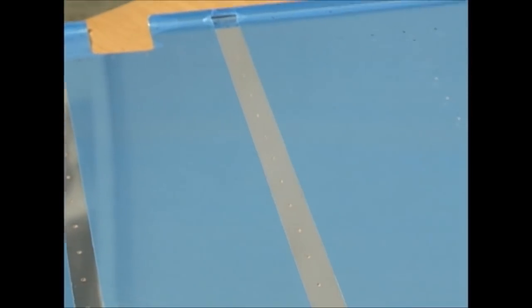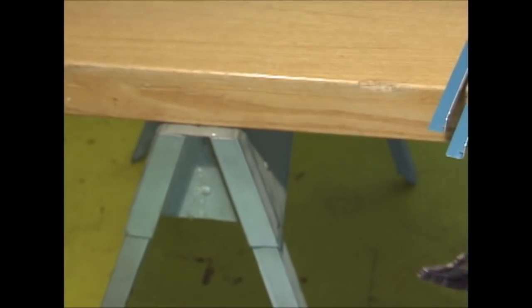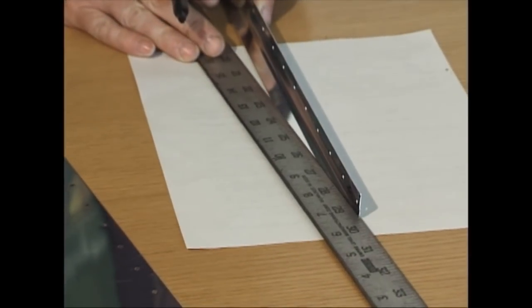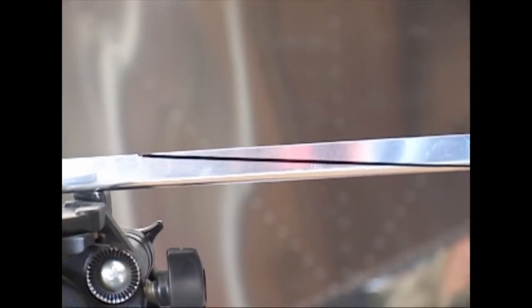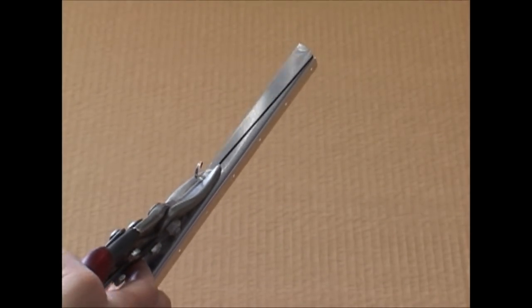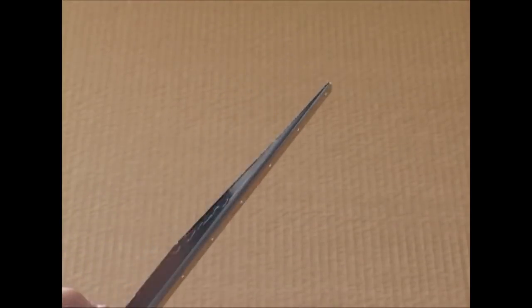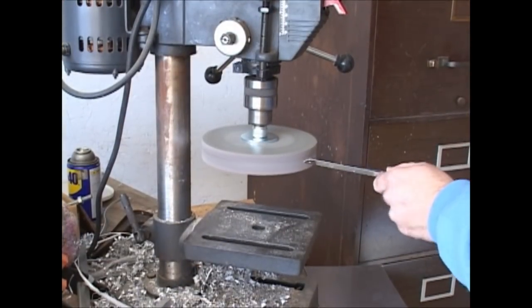In this example, we are selectively peeling away the protective coating so that we can prevent the surface from being scratched while riveting along those rivet holes. Here are the stiffeners which we are preparing, and by just following the directions, we're going to make trim marks and then use our sheet metal shears to cut them to shape. With any sharp edges, we're going to take them to our 3M buffing wheel and clean up those edges.